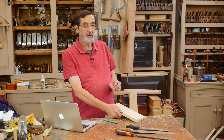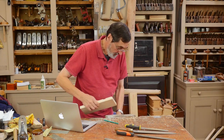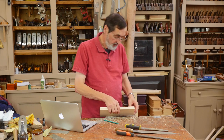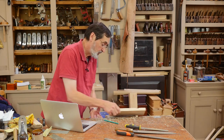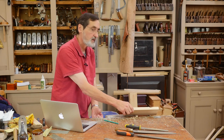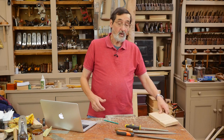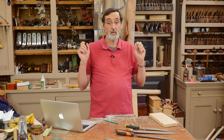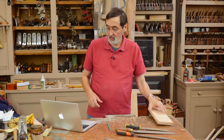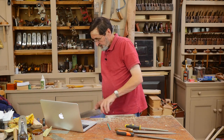And then there's a couple of things you can do to plane that. You can drop it into the vise like this. So you've got a long length, remember. You hold it here, you take a shaving off, move it along, take another shaving off, and that would work perfectly. So you can do that. How accurate that would be is entirely up to you. There are ways that you could suspend it so you could get it pristinely accurate all the way along. But that will give you a guide in what you can do to make that work.